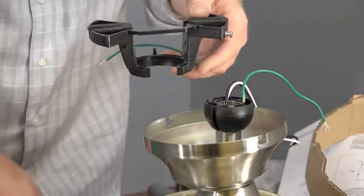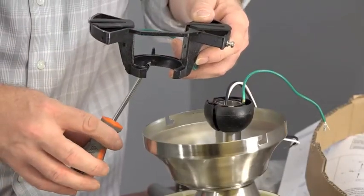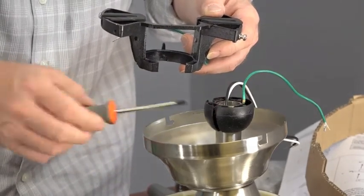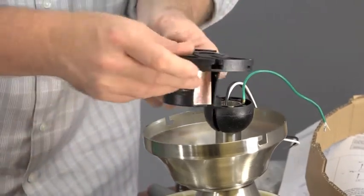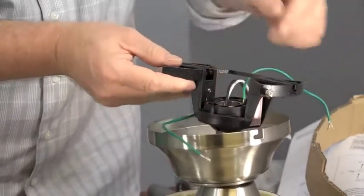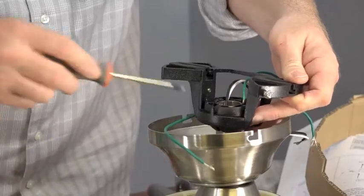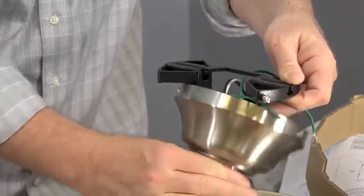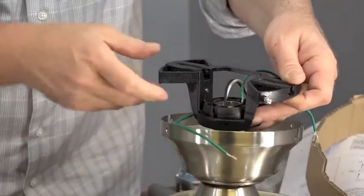The slide-on mounting bracket features a notch located at the base of the bracket where the ball will sit. The alignment slot in the ball and downrod assembly will line up with the notch. This demonstration shows how the ball should be properly seated in the mounting bracket with the notch aligned in the alignment slot. This will ensure stability of operation and prevent the fan from moving.